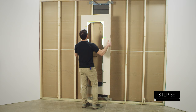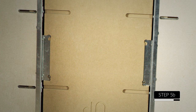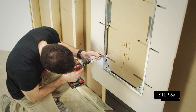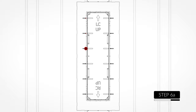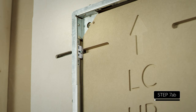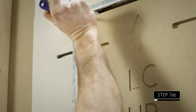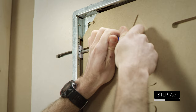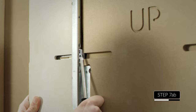Position the install board on the back box by seating the positioning brackets into the pockets on the positioning board. Make sure all the brackets touch the bottom of their pocket. Secure the install board to the studs through the 12 slots. After you've screwed the standoff brackets to the framework, tighten all the adjustment blocks — while doing so, push down the nearest positioning brackets so they're sitting flush at the bottom of their pocket. You can push while you tighten the nearest adjustment block, working your way down each one.